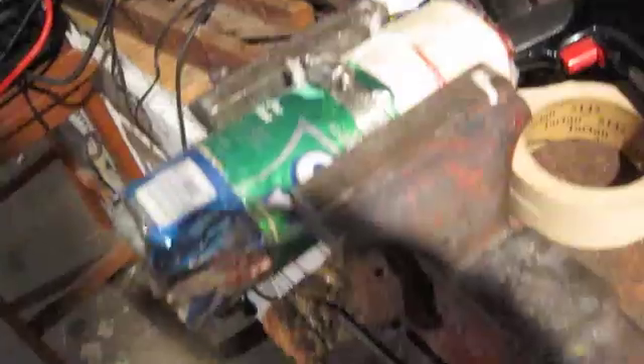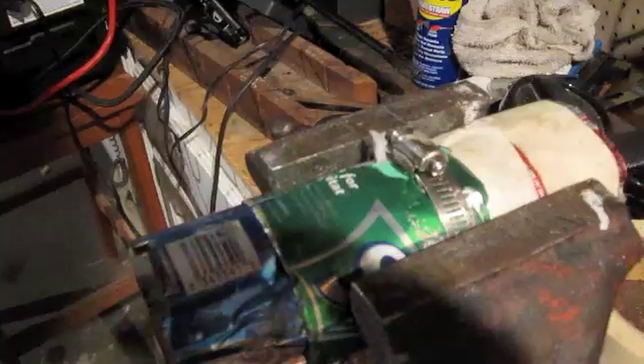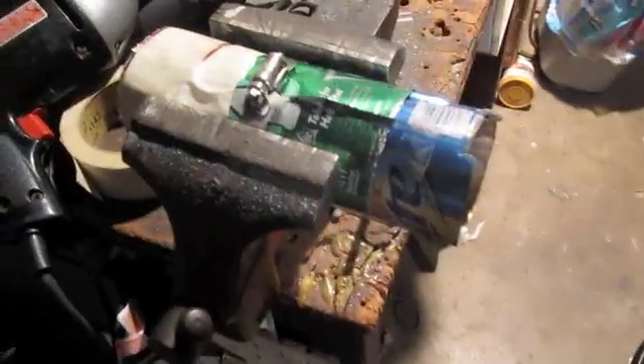You've got to put it at a distance. This is the completed jet engine. I've made a few minor modifications: adding an aluminum sleeve around the combustion chamber and around the original compressor inlet section. Behind that aluminum sleeve I've also added another lip on top of the flame holder I made last time. Hopefully that'll make a slightly larger combustion chamber that will compress the gases a bit more and give us sustained combustion. I just need to figure out a way to make the turbine spin before I light it.